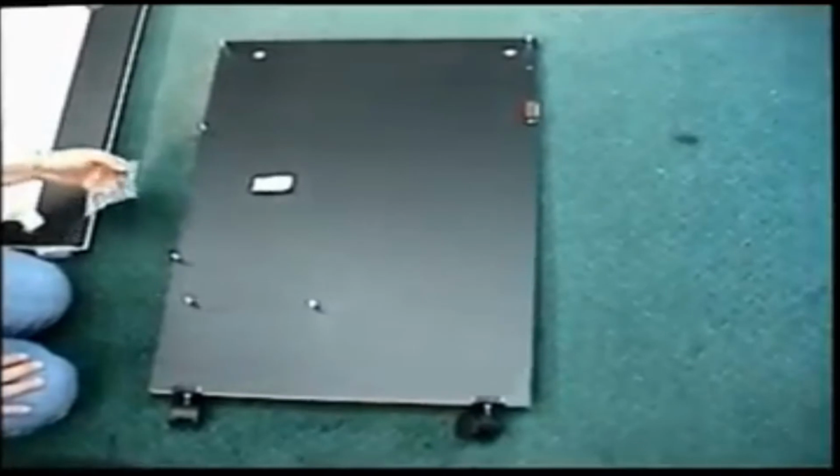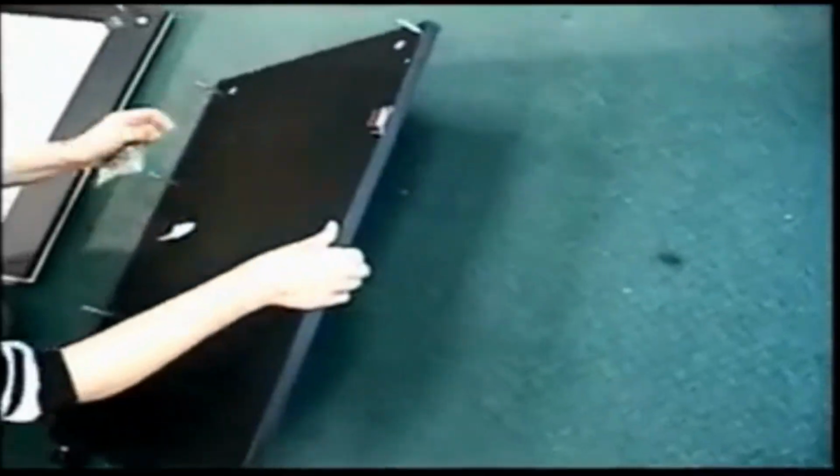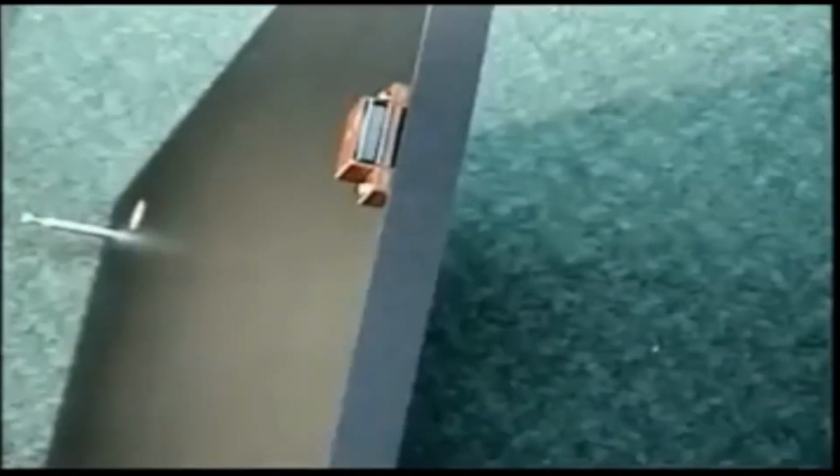On panel D, we also have one additional piece of hardware to install. It is the catch magnet. It is screwed on with two screws that come in the bag with it, along with the metal plate and screw for the door. Be sure that you place the catch magnet with the metal strip facing out.